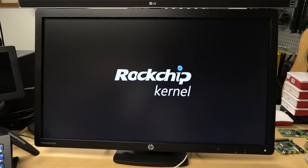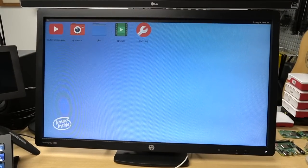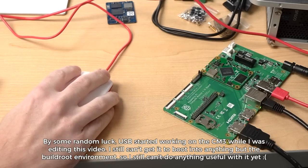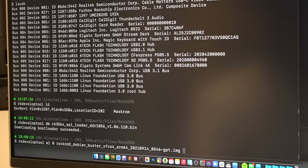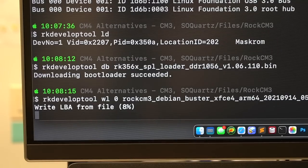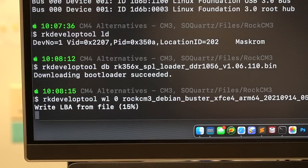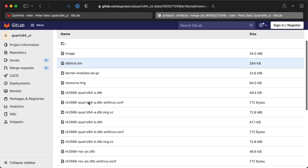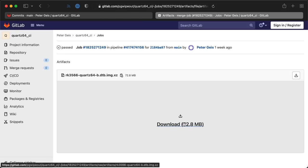But here's the problem. I've already spent about eight hours with both of these boards, and so far I can't get either of them to boot into a usable state. The CM3 I got came preloaded with some sort of Qt environment running some flavor of Linux, but I can't log into it via SSH, I can't use USB keyboard or mouse to do anything with it, and even after reflashing the eMMC a few dozen times I still can't get the thing to boot into Debian. The SoQuartz wasn't any better — there's no getting started guide at all yet, and I only found out there was a sort of working image to download when someone pointed it out to me on Discord.